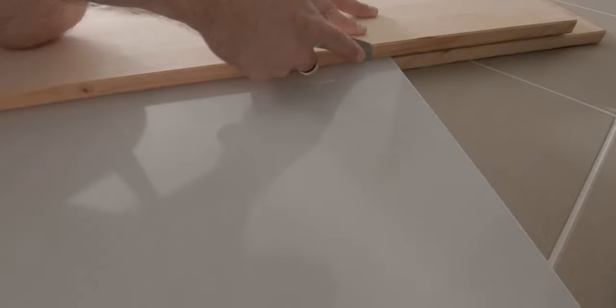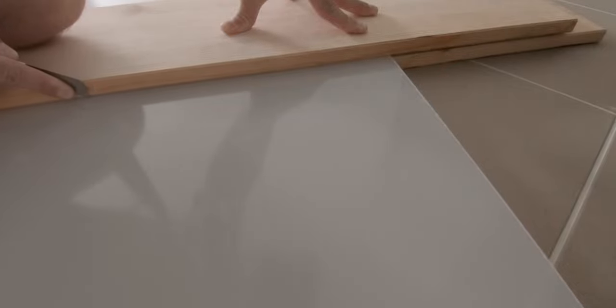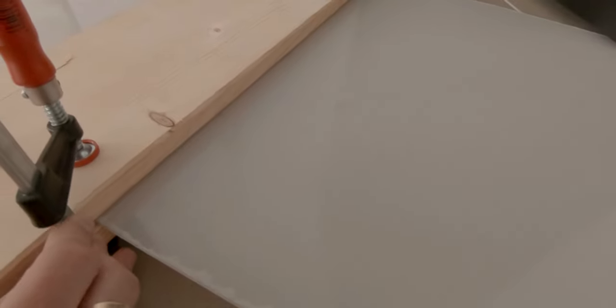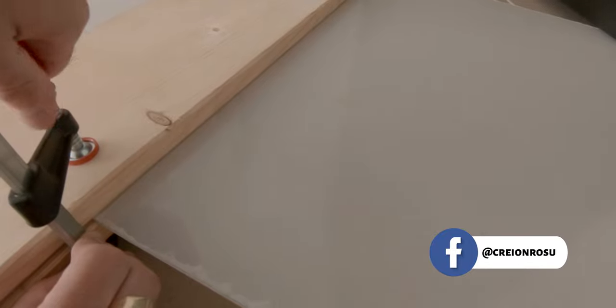I found online a lot of useful tips when it comes to the best way of cutting the panels, and the method I used was to break them along a scored line. After measuring the size of each panel, fixing some wood planks on both sides of the line, and making some scores along the line, all I had to do was to force break the sheet.